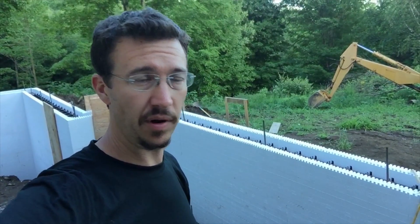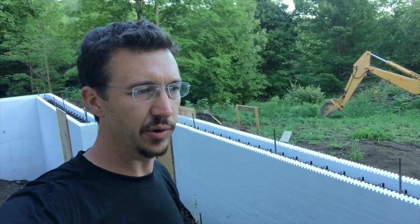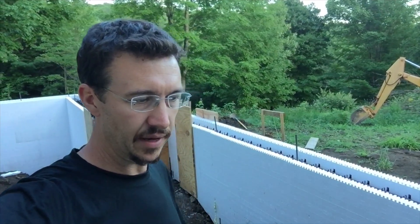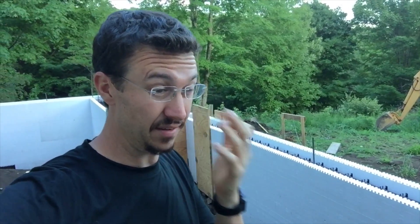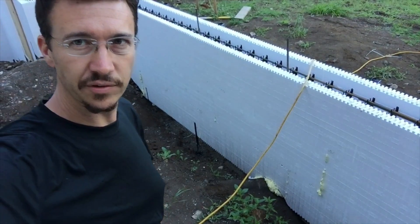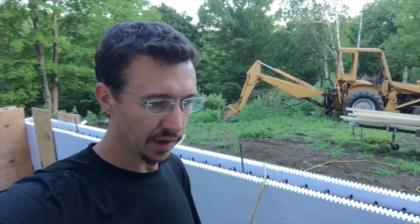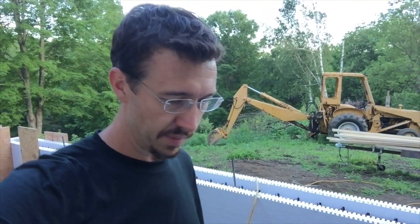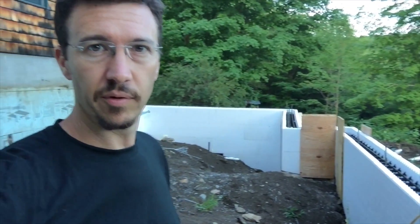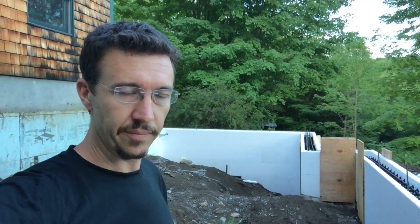So that's the addition project and kind of where I'm at with these ICFs. It was super hard to get started — I was confused about how I would go over this ledge and still be confident in the wall's ability to be what it needed to be. But finally I settled on this fast foot method, screwing these to the bottom and adjusting it. I really think it's the way to go for this application. It may not be what you need, but I think it's actually going to work out pretty well. Thanks for watching.